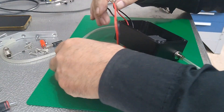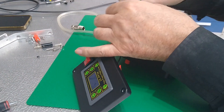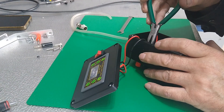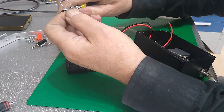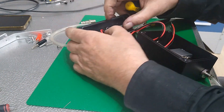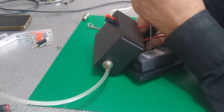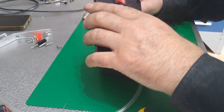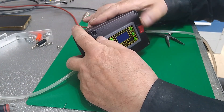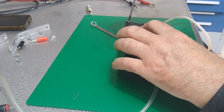The wiring diagram is very straightforward: 24 volts go through two wires to the switch, then two wires from there to the controller, and finally two more from the controller to the valve. There's one phenomenon that some might be less familiar with: when the driver cuts off current to the valve's coil, the energy stored in the coil has to go somewhere. The result is a very brief pulse with a nasty high voltage, known as inductive kickback. That little spike can kill the controller electronics, even though most units have some protection built in — but better safe than sorry. A small diode costs next to nothing and keeps that nice little controller safe.